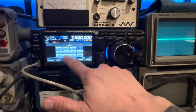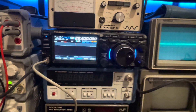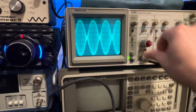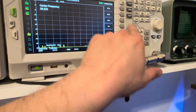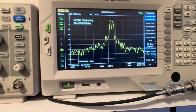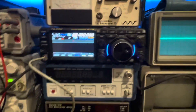Now we'll go over to the 10 meter band and look at it there as well. We're right in the center, upper sideband now instead of lower. We'll key up again — same 80 watts, same settings. There's our linearity at 10 meters. We can change the frequency here and look at 28.400 MHz. Let's key it up again.